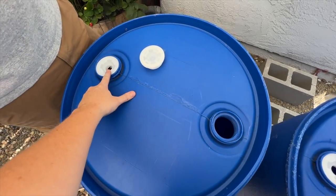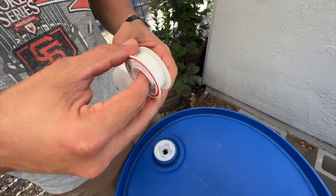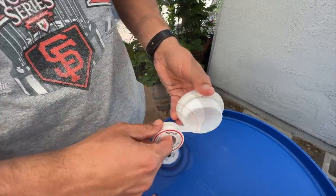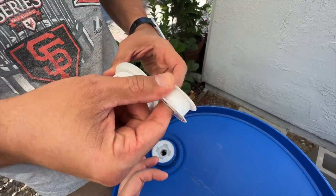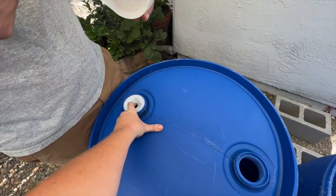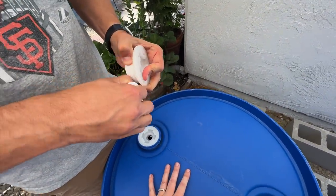So I've got this one all sealed with silicone. Now we are sealing the other side with Teflon tape, or plumber's tape — he's going to hold it in his left hand and wrap it away from him. Blue Barrel recommends four to five wraps, so that's what we're doing. The tape gives it a nice cushioning to seal any gaps around the fine threads. This whole barrel will be sealed except for the hole where we connect the whole PVC pipe manifold system and get our water from. These are upside down, so we'll flip them back over onto the cinder blocks.